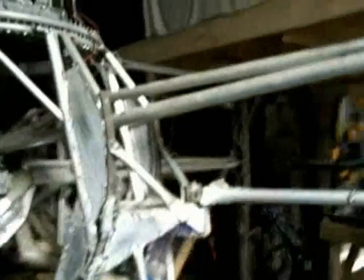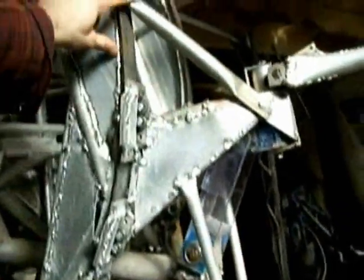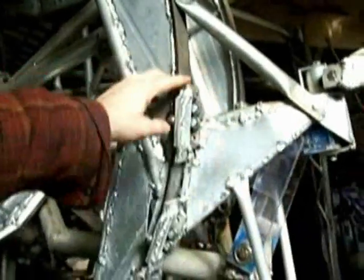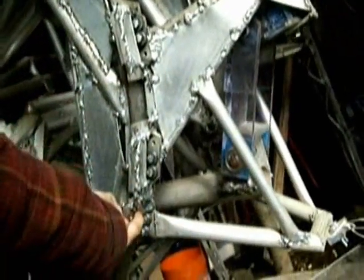Last time I put these things on, and now I have to kind of lock down the rest of this slidey part. Because this is probably enough to keep it from moving, but I don't want some of these roller parts to rip off and the whole chunk to fly off — because that would kind of suck. So I'm going to put some bolts in there: one, two, three, four, and then four on the other side, so that's eight, and then times three is 24. I'm going to be drilling 24 holes, tapping them, and putting bolts in. That'll be pretty exciting.